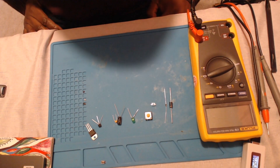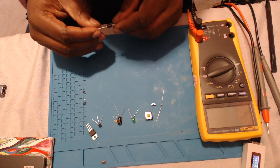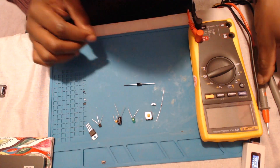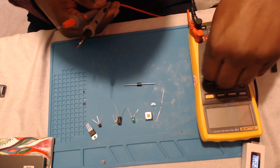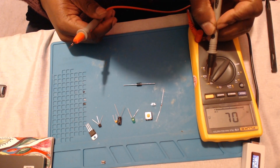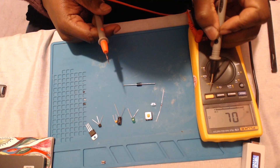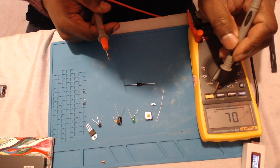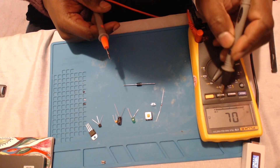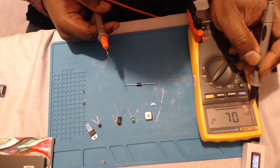In this video we're going to look at how we can conduct some simple tests on electronic components commonly found in circuit boards. Let's start with the diode. First, let's get our meter into the appropriate setting, which is the diode mode. This is represented by a cross just on top of an arrow. Notice these symbols are in yellow or orange color, which means we need to use our function button on our meter to get into the diode setting. Notice on the screen it changes from the speaker icon to the cross icon as I press the button. We're now in diode mode.